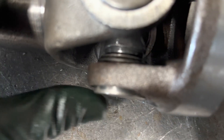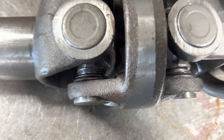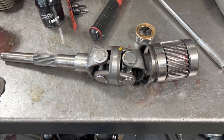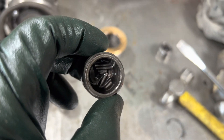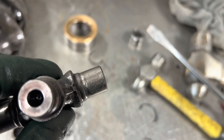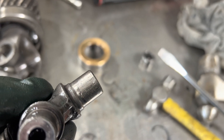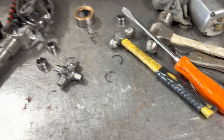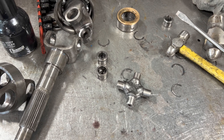You can feel it - there's just a little bit of back and forth. It didn't really come up on the camera, but there's play in there, and that's one of those needles that got out and trashed the pump. So we'll get these U-joints out of here. You can see half of those are broken in half and smashed, and on this yoke look at the wear and the lines right there. That U-joint failed - a couple of those little itty-bitty things broke in half and ended up in the pump and trashed it. But we're going to fix it up.